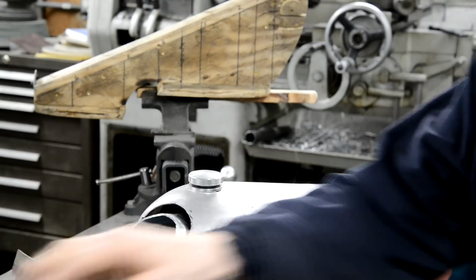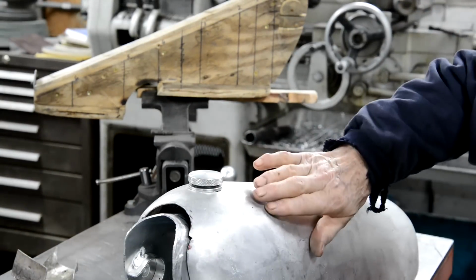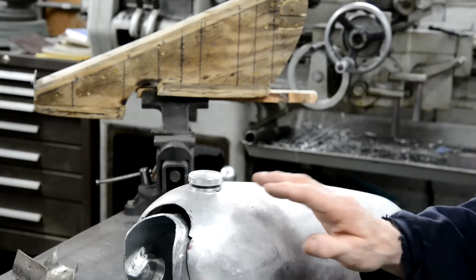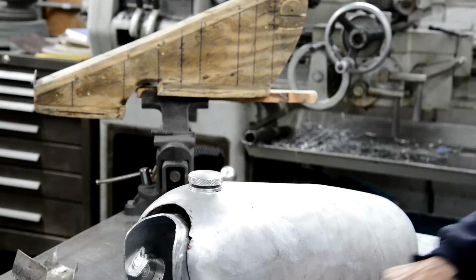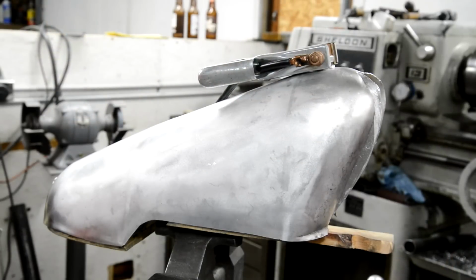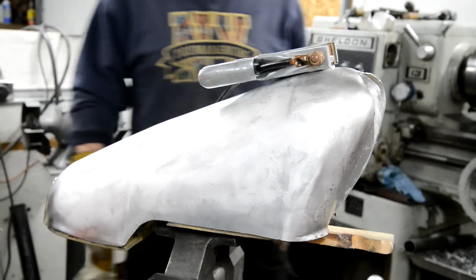Right, what I'm going to do now is give this a rub over with a coarse Scotch-Brite, because with a bit of shine, it'll show me any little bumps and things that I might have missed, creases. I'll slap them out and then we'll see about making sure everything fits ready for welding. Right, well, I think I've got this top skin about as good as I can get it. It feels fine everywhere. Some minor things, but...